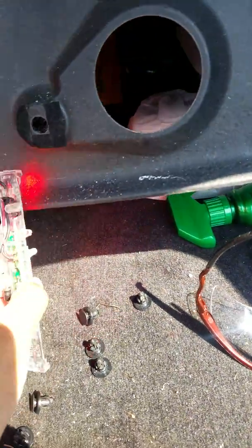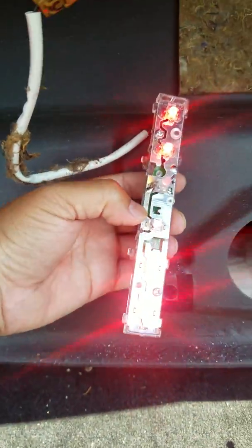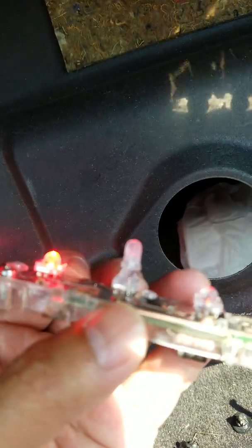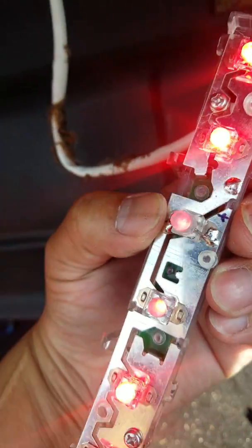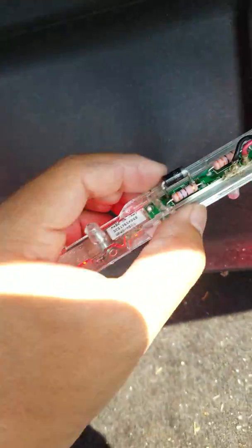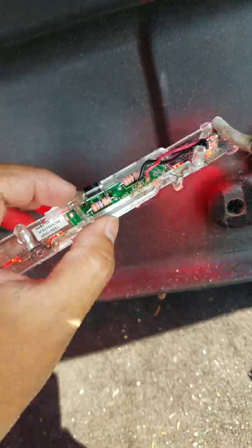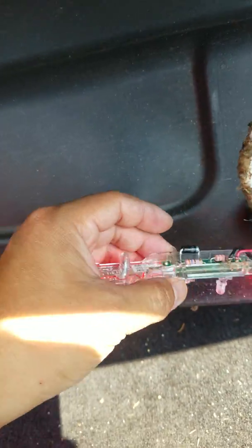This is how it looked — it's working now. This LED was not working, so I ghetto rigged it and put another LED right across it. At first it wasn't working, so I took out the diode right here, which is usually the cause of dim lights or an LED not working.